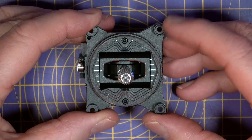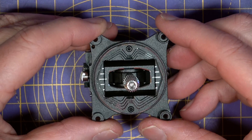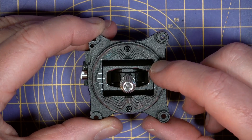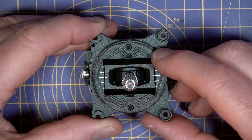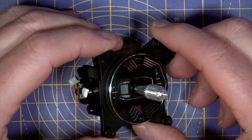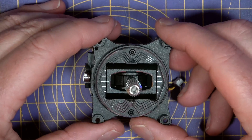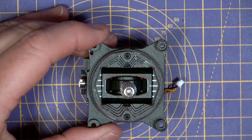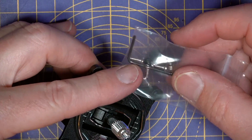Although hall effect sensors are non-contact and very smooth, they can suffer from temperature drift. I tested this with the full-size AGO-1 gimbals, and these look to be exactly the same electronics. The spec says the working temperature range is minus 20°C to 85°C, so you should be okay. These weigh just 42 grams each, and you'll need two. RadioMaster don't sell a specific non-self-centering throttle gimbal, so you'll have to set that up yourself — but it's very easy. They supply the necessary hex tool, some spare tension springs, and some screws.